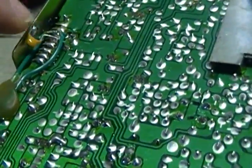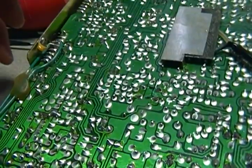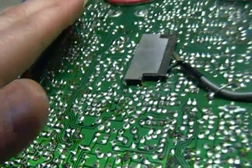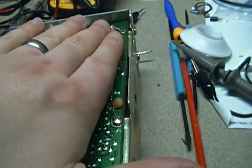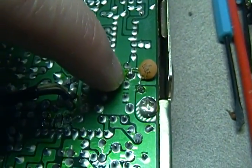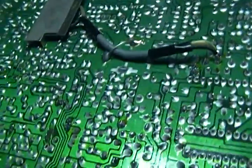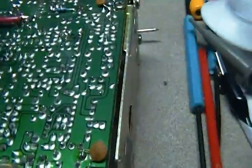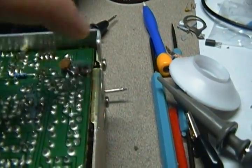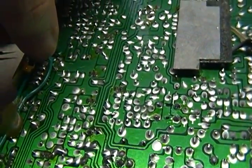Here's your audio IC and this is your power IC — an older type. Being the audio side, I was getting the issue in audio and in receive. I used these capacitors — here's the ground to my frame. I soldered this from my circuit board ground to frame ground. This IC leg right here is my circuit board ground, and I soldered the other capacitor the same way on the other side.